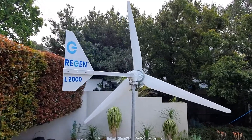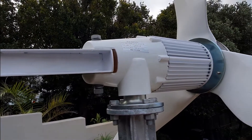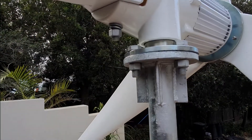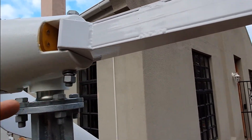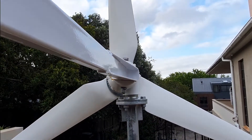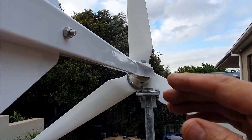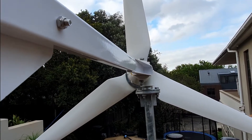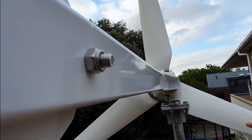Right, just to recap: the open end here must be on the side of the shaft. The little shoulder bit here must be on the opposite side. If you look at the orientation of the bolt that goes through the back — you can see it nicely from here — that little bolt goes through at an angle like that. That is to allow the breakaway function.